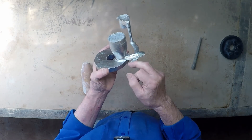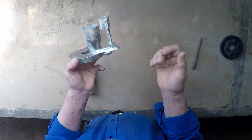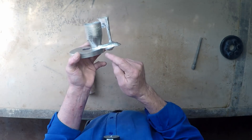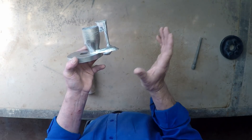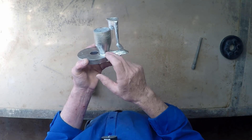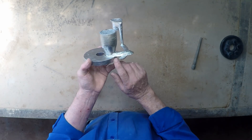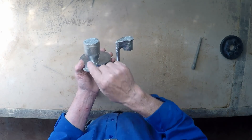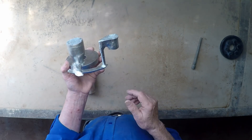Now the gate itself connects to the back of the casting. That's actually not perfection — it is stated that you really should bring your metal into the lowest point of the casting. It was a little difficult to do that here, and the distance the metal would fall from the gate to the bottom of the casting is very slight, so it's probably not worth worrying about. The gate comes into the bottom of the riser, which has the advantage that after the casting fills, the riser fills — so the riser is getting the metal directly from what's being poured, meaning it will be full of the hottest metal in the mould.